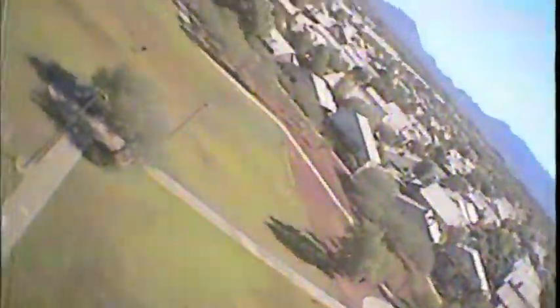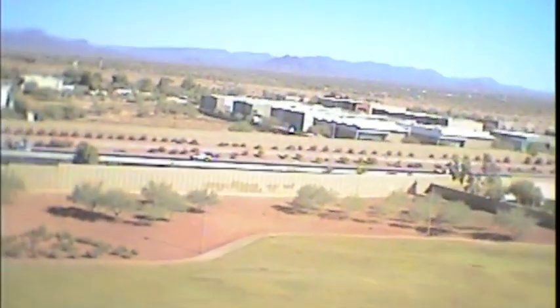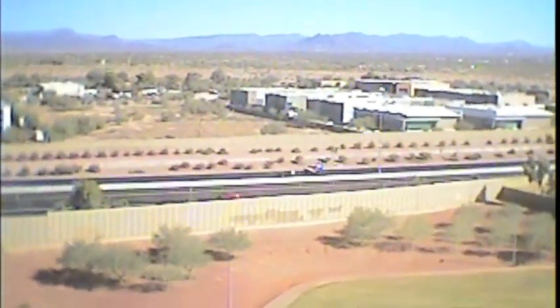This was the max payload test flight — the normal configuration plus 600 extra grams worth of battery on board. Even though this is really short range, you can tell that with these stock omnidirectional antennas there are quite a few dropouts and interference. I'd say it was adequate for an intro FPV flight, but I definitely plan on trying some circular polarized antennas in the future.